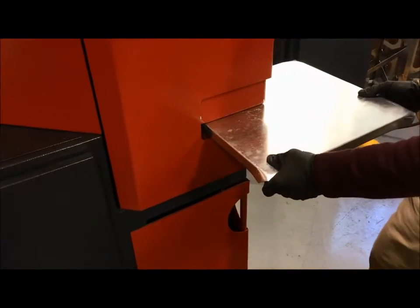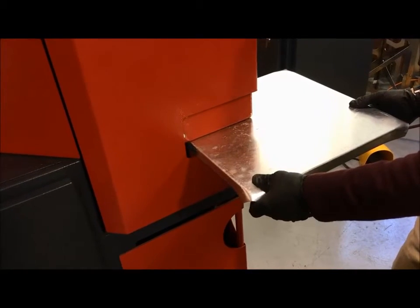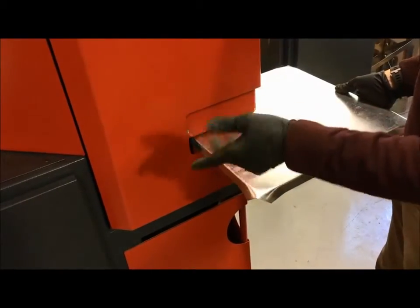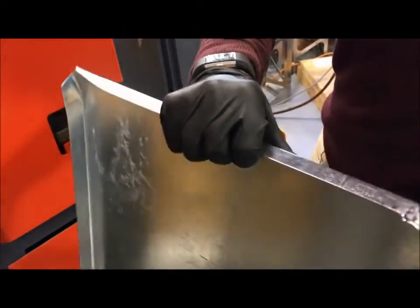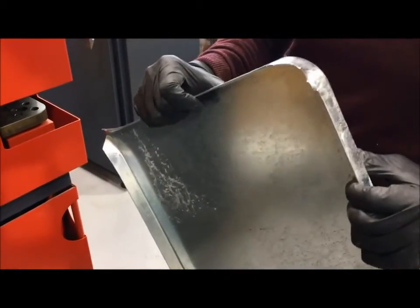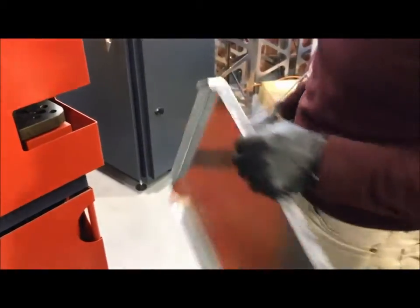I'm going to go into the corner, roll over it twice to make it a little bit smoother, and then it opens again. That is your pre-formed edge and you see we don't have a rollover. We are able to make this height out of 1.5mm, which is about 23mm overall, outside to outside.